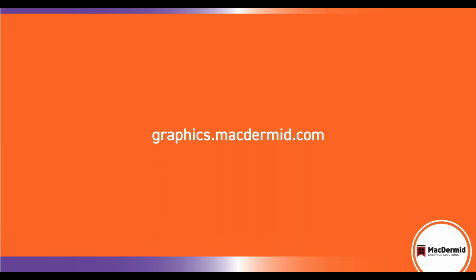Great. We're coming to the last few questions. Is a shallower relief required to hold the minimum dots? No, actually, the dot structure that we have in the imaging package does not require us to shallow up the relief, if you will. So it runs typically with the normal reliefs that you would expect on a corrugated flexo printing plate.